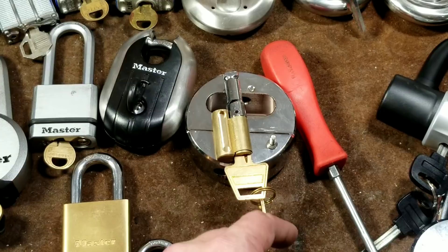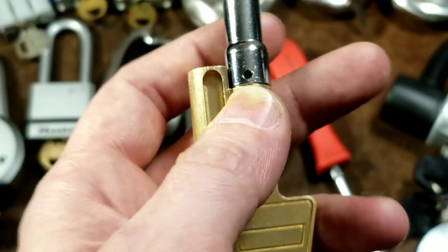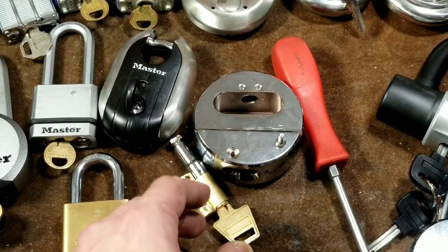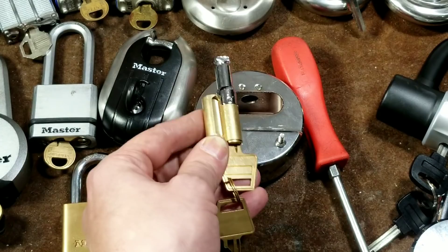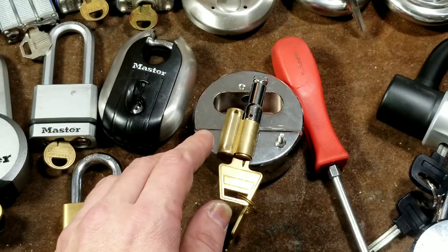For $12 and about another $3 at a locksmith plus a piece of an Allen wrench to make that pull-out protection a little bit better, for $15 you're going to get a pretty heavy-duty lock that will be very difficult to get into or physically attack in almost any fashion. There's fortunately no cast zinc or anything to worry about for torching attacks. With a little knowledge of how the core works, you can take it apart and upgrade it with six high-security pins from American locks — a six-pin lock that's quite difficult to pick, especially for a criminal trying to do it upside down when it's locked to a trailer.